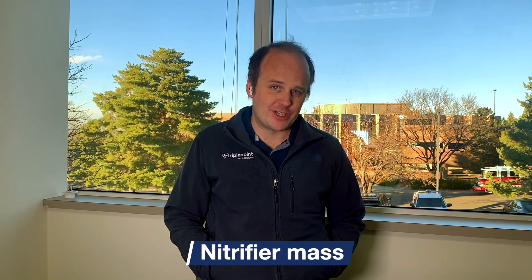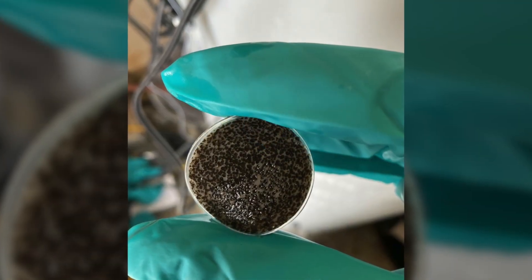The next thing you need is nitrifier mass. If you're going to nitrify, you need to grow a lot of nitrifiers. All the real systems used to upgrade lagoon systems are what's called attached growth systems, meaning they have some kind of substrate within the system that the nitrifiers attach to and make their home. In our Nitrox system, we've recently started using a very high surface area medium — for each cubic meter volume of media, we get a lot of surface area, which means we can grow a lot of nitrifiers. Generally speaking, the higher the surface area, the more nitrifiers you can grow and the more nitrification you can achieve at lower temperatures.